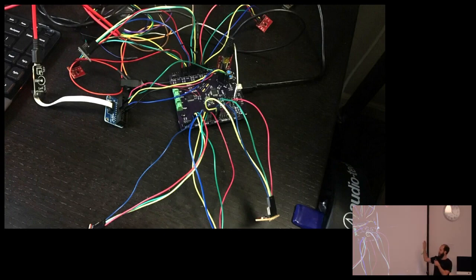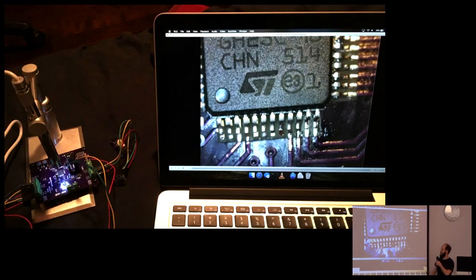This is kind of what it looked like back in the day. So I had all these different temperature humidity sensors just to test out my software. It's basically sending it all over USB serial, and then I have my computer measuring that. And then you can set one of these temperature humidity sensors. You say, okay, this one's outside the fridge, this one's inside the fridge, and this one's in cheese aging container 1 or 2. And that way the controller can turn it on and off as needed. You'll see there's a Black Magic Probe over there. And yeah, so that's that. Little hint, get a USB microscope that's really cheap, because when you're soldering, it really helps.